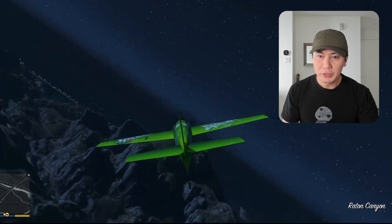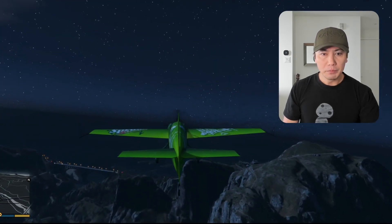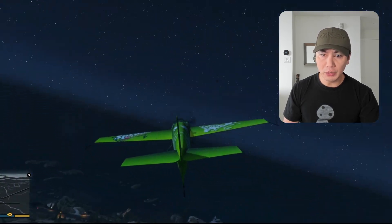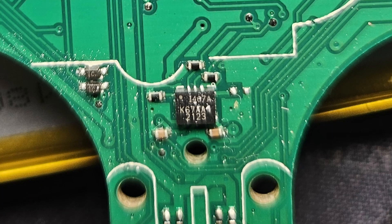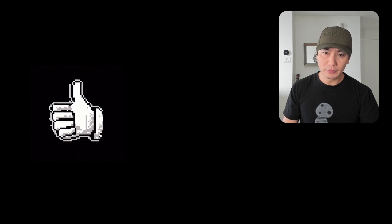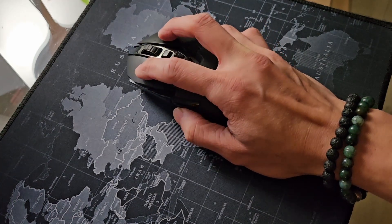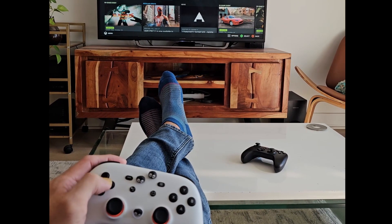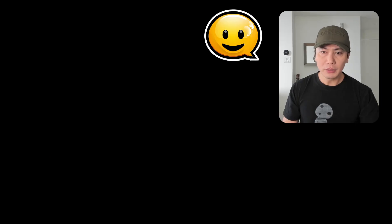MEMS gyros are getting better though, especially in aerospace. The expensive MEMS gyros have a measurement range almost as good as the fancy optical gyros, but the cheap MEMS gyros in our game controllers are not there yet. So the question is, which company is going to be bold enough to bring high precision gyros to its game controllers? Do you think I should look deeper into the chips in our game controllers and build a test suite around them? Subscribe or leave me a comment — that would be a great indication that you're interested. For now, gyros won't replace the thumbsticks in our game controllers and unfortunately won't beat the mouse either. It can however do more damage than the mouse; it is a great complementary input to the thumbstick and its applications in VR gaming is undeniable. Gamepads are still my go-to for gaming and gyros just make them better, so I'm happy to have them. What do you think? Let me know in the comments below, and thank you!